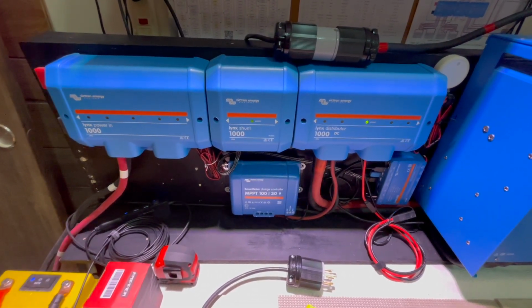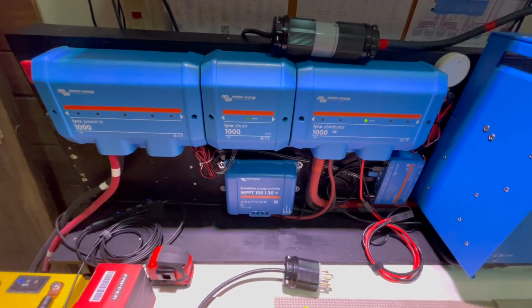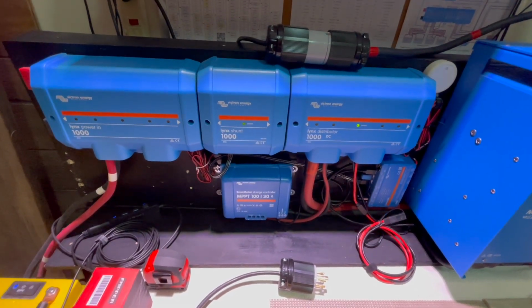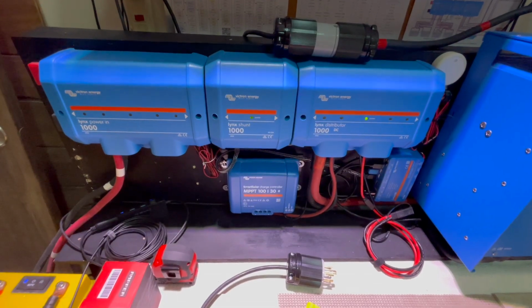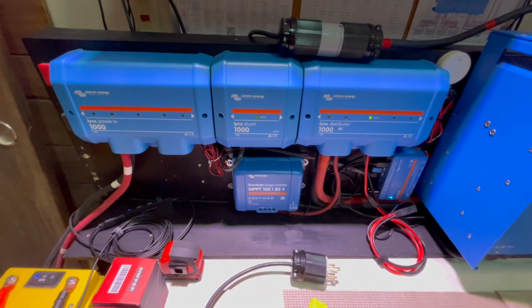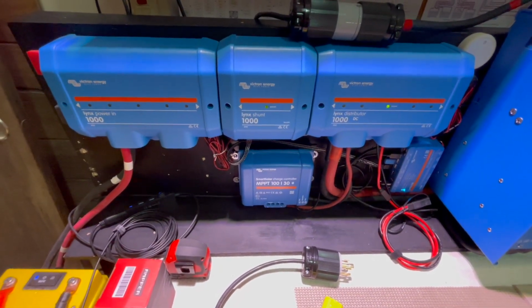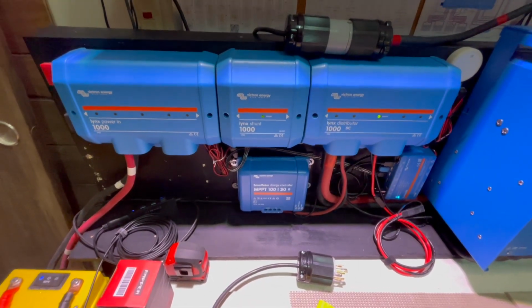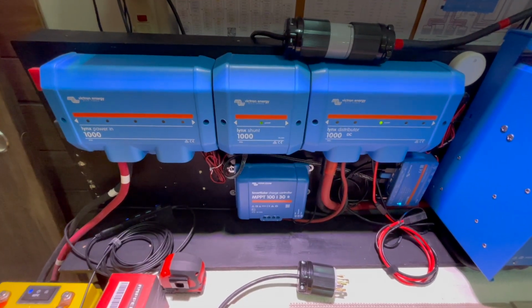Imagine minus 30 outside, Celsius or minus 40 Fahrenheit or Celsius. You use a lot of battery power because there's about 200 amps drawn to heat the air for the diesel truck to start. And you drive for 10 minutes and then it sits all day, still cold. In the evening, start it up the same way, drive 10 minutes. It doesn't take long before you get a low battery voltage message.